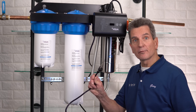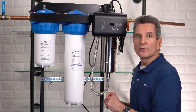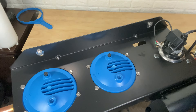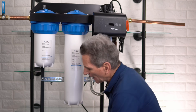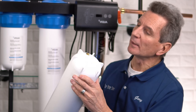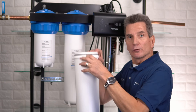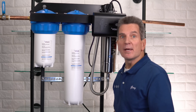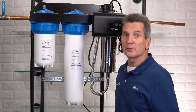Next, unplug the system from the wall. While the lamp is cooling, this is a great time to change the filters. Each filter housing has a button at the top to release any pressure — press those buttons and see if any water comes out. At the bottom of the filter housing you'll see a brass plug. Unscrew that to drain the water out of the housing while you're changing the filter, making it much lighter and ensuring all pressure is gone.